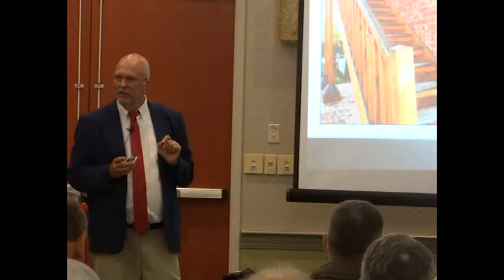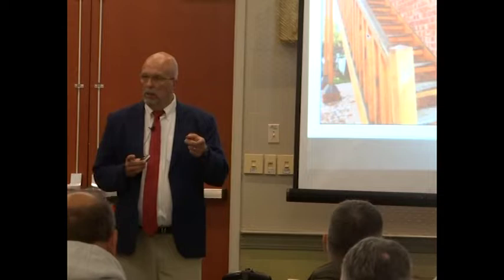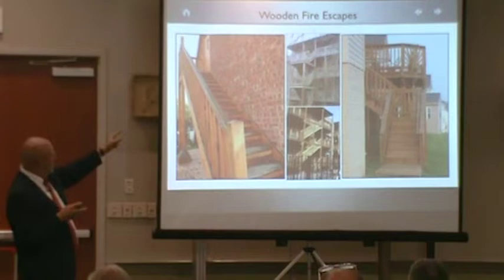A lot. But then you give them the warning as a building official: somebody else is signing off on this, but in 5 years I want a brand new one here, or go to metal. Otherwise, yes, you can go to wood, but you better replace this in 5. It's almost like a reprieve. I see a lot of metal and a lot of screws, no more nails, no more machine guns. You know how many times I've seen machine gun fire with that wood system, 8 nails in a connection somewhere at the end, and then the whole thing fails. All right, so these are going to get done for that one. Okay, let's do that part.